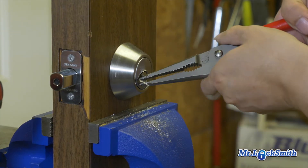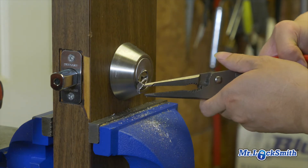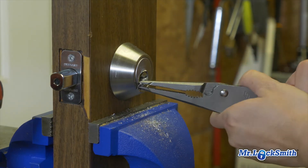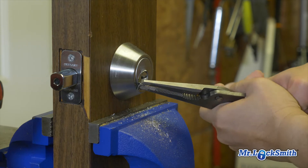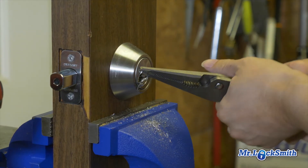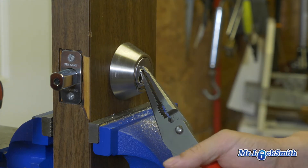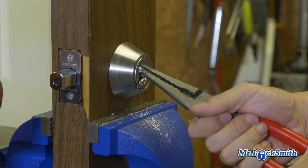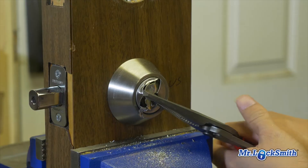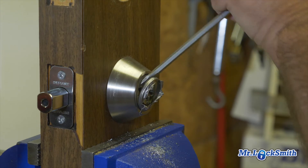What we're doing now is seeing if there's hard plate in here. In theory, we should never have been able to drill the shear line with the hard plate. I always drill it anyway — it does have a hard plate, and sometimes the hard plate gets in the way, but sometimes not at all. In this case, the hard plate didn't get in the line. There's the hard plate — pop it out now.